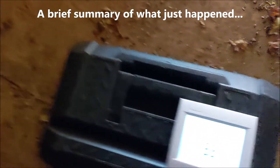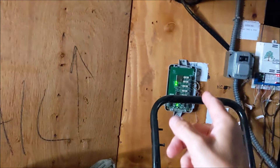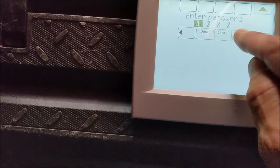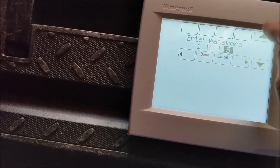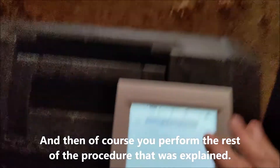Just to reiterate: resetting is simply pressing the connect button for 10 seconds straight. When it turns to color, you can let go. When it's ready to connect, just press the connect button quickly. Do the reset there, then go to menu, installer options, 18-47. Then go to reset and hit yes — I'm not going to hit yes now, because I don't want to reset it. Then go through the setup options shown in the previous part of the video.